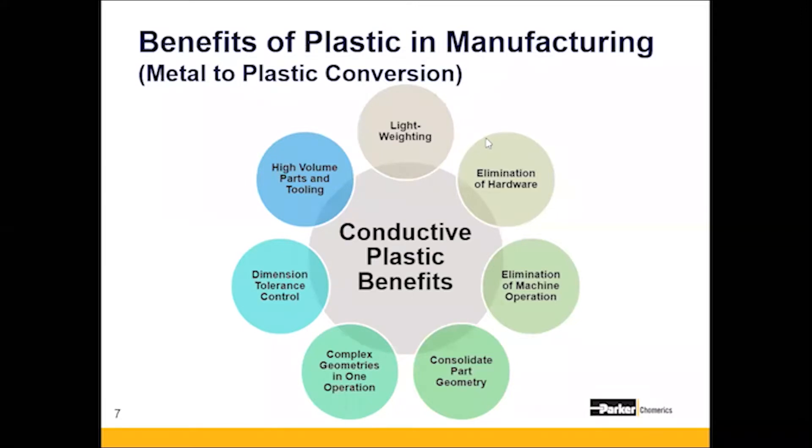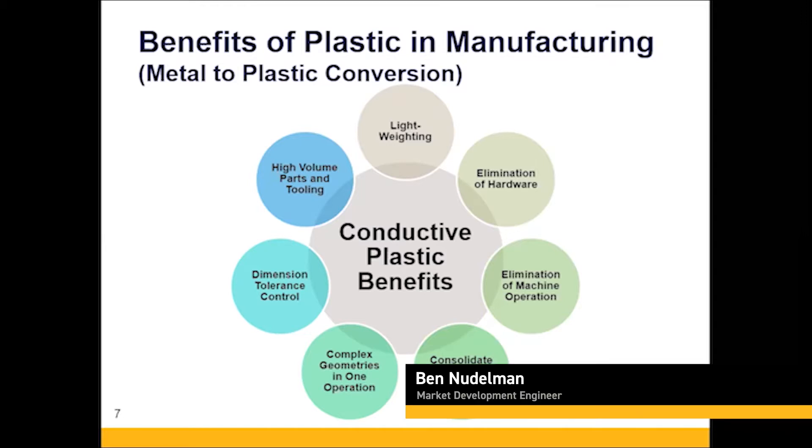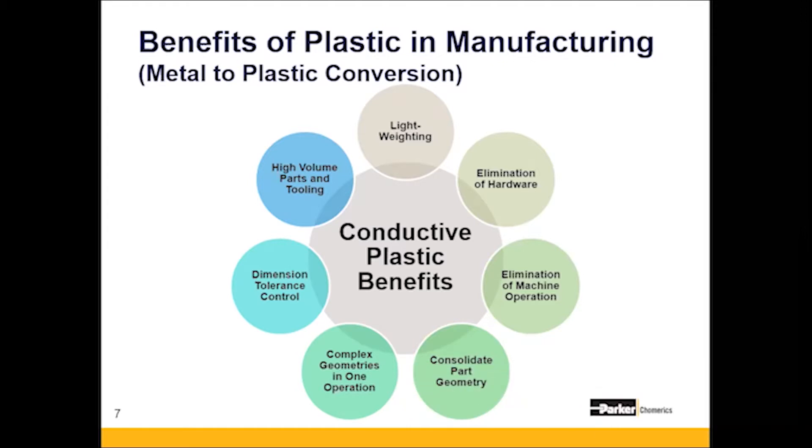You can also eliminate a lot of secondary operations such as machining of die-cast housings to achieve tighter tolerances. You can replace machined holes with thread-forming screws, and you can mold with no machining for really high-tolerance fits when it comes to under an inch diameter type designs. You can mold a single complex geometry in a single go — tools can include very thin walls that would typically require hours of machining or several sheet metal parts. Tolerance control with conductive plastics is on par with the highest machined parts, at one to two thousandths — far more accurate than die cast and sheet metal.